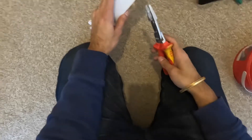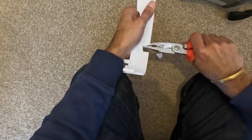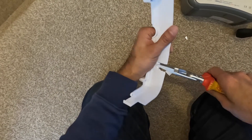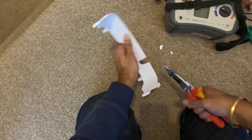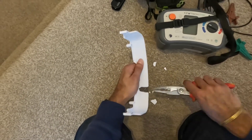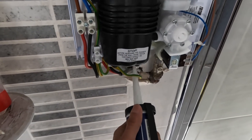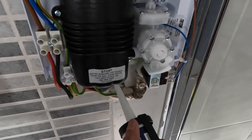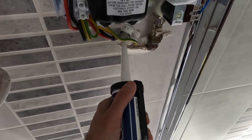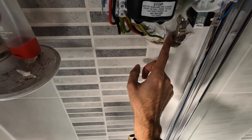You also need to check for leaks when the shower is on. I'm making a slight adjustment with the bottom clip cover at the tray side of the electric shower. At the bottom there's a little cover used so you can have the copper pipe coming through from the wall going into the shower — sometimes it's underneath, sometimes on the side, so you alter it accordingly. Make sure any holes are sealed up, because you don't want water going behind the tiles — ensure any water drips down over the top of the tile rather than behind it.